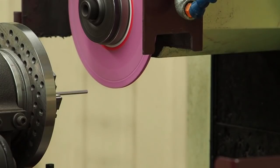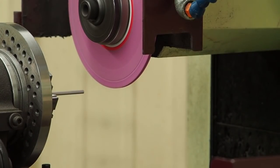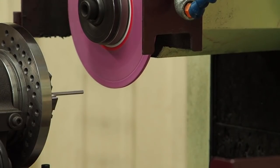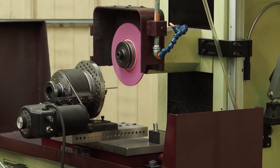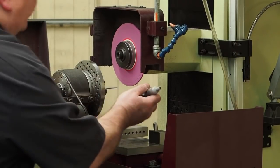Okay. It took a little over 16 thousandths off. I think we should be under 150 thou. And keep in mind that this is 16 thou per side, so 32 total, and I haven't dressed the wheel. Another thing that's interesting was I did push this up and I started getting a thou per side. I think what was happening, I had to break that leading edge in a little bit, and once it broke in, I could pick up that thou per side, which I thought I did in the past, and it actually sounded pretty good.